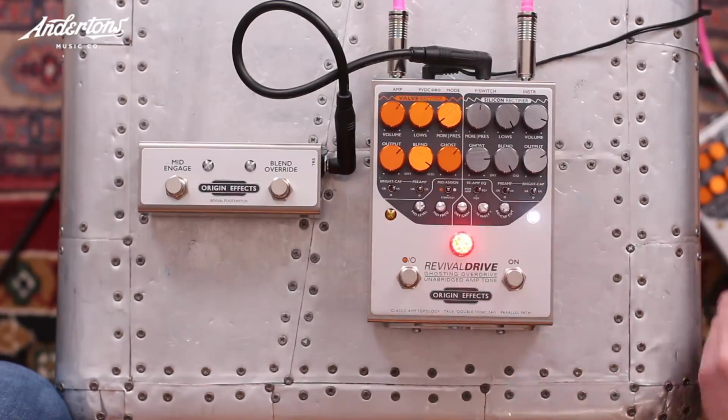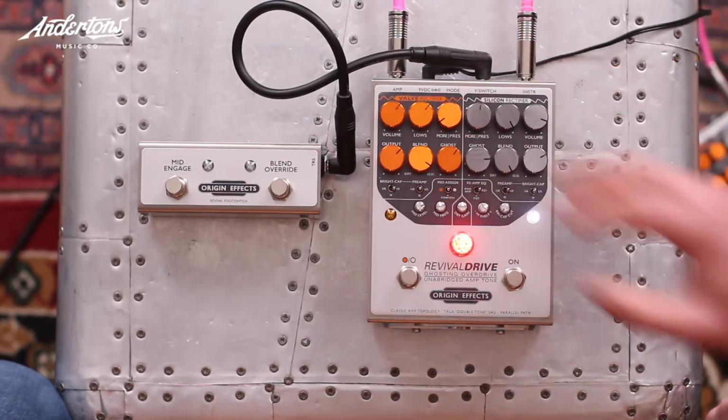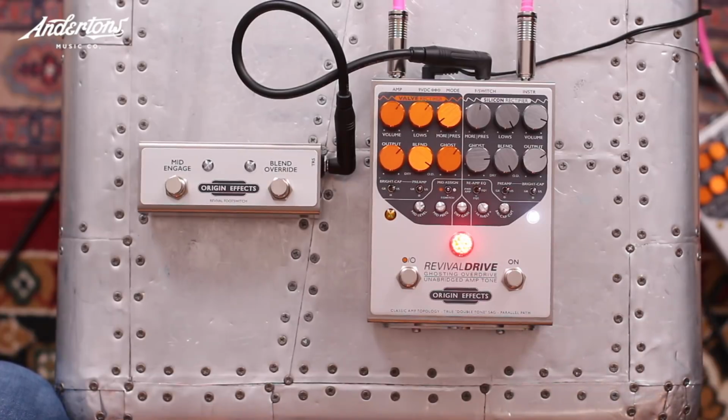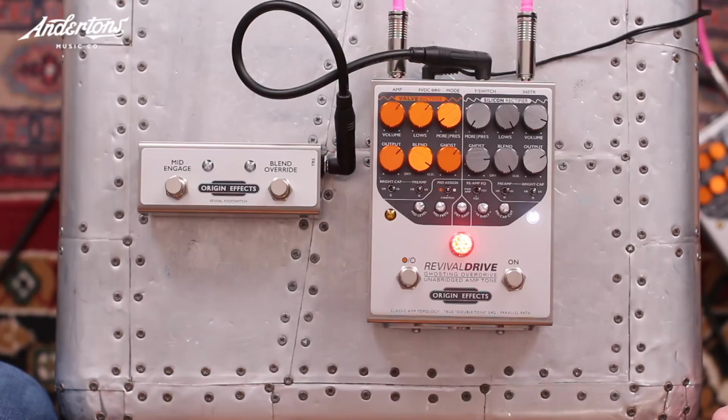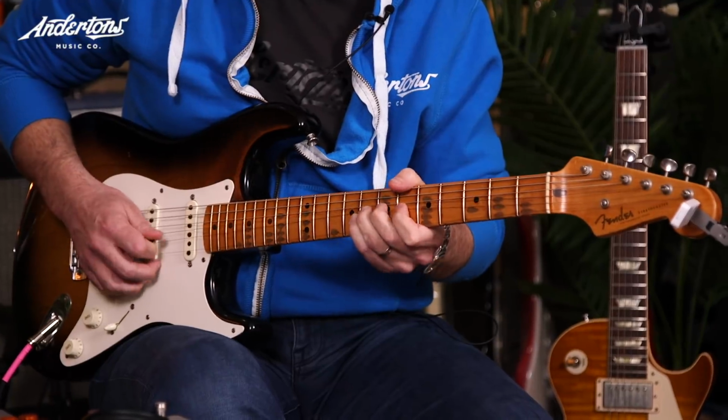And then if we turn it in the opposite direction, it changes the way this reproduces the output stage of a valve amp. As you turn it the other way, it reduces the negative feedback, which opens up the output stage, giving more gain across all frequencies. So if we turn it... It's like you say, it hasn't rolled the treble off as such, has it? It's just boosted everything in that one. It's more like an AC30 where it's... Oh, sounds good. Can't wait to hear Pete and Josh play this. It sounds great.